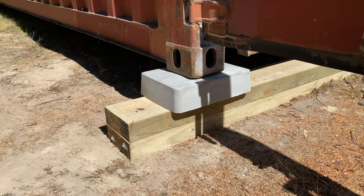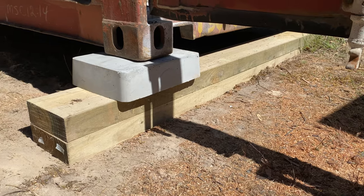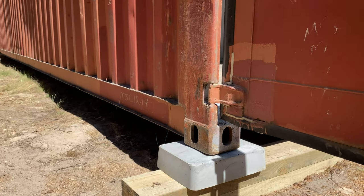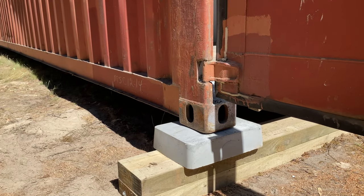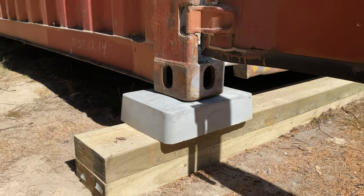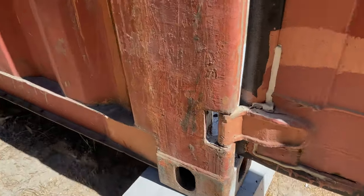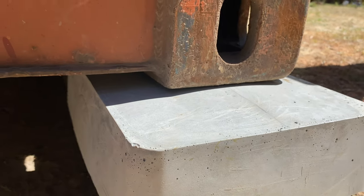To start with what we had to do — I got a couple of sleepers there. I had to put down treated pine sleepers, 200mm by 75mm by 3m long, and a container is about 2.4 wide, a little bit over. So I had to leave a little bit of extra room, and that 3m covers perfectly. I made up these little concrete blocks just out of some 27 litre plastic tubs — they only filled about halfway — but they worked really well. The only thing was the tops bowed a little bit, but that'll settle down.